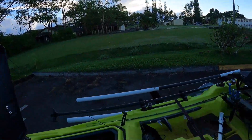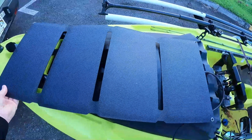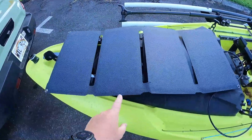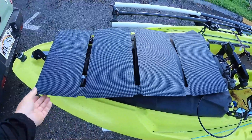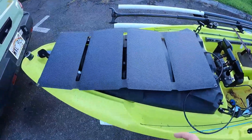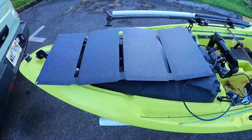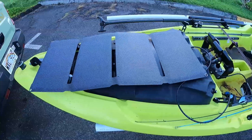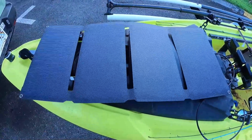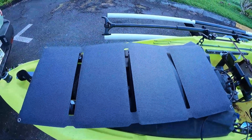You can see the battery is flashing, meaning it is getting a charge, but it's not really registering anything right now because that cloud cover just rolled in and it's going to be a fairly overcast morning. This particular solar panel is small enough that it just sits right here on the front of my kayak. It's advertised as a 50-watt solar panel; the battery is advertised as having 640 watt-hours, so if this was the only thing charging it, it would take 12 hours to charge.